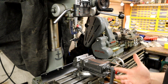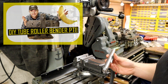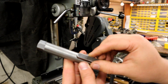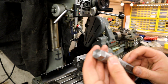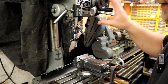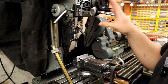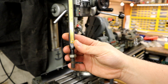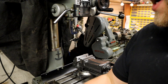My previous video has been me working on making a tube roll bender. To do that, off camera I've been making these shafts, which consist of a keyway being formed in and making a hexagonal end drive end for me to use a socket bar onto. Previously this had a kind of setup which is quite familiar with these Chinese round column milling machines - a scale that I'm sure has worked for many of you, but for me it's not really getting on with it that well.